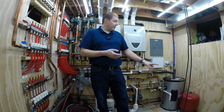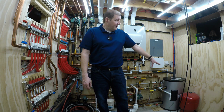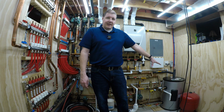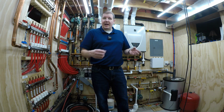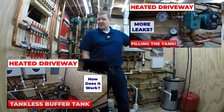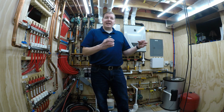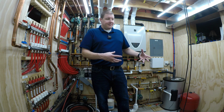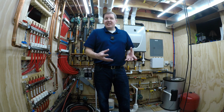So I'm also going to be doing some videos on converting my buffer tank here, which is an electric tank, an HTP 20-gallon electric tank that I took the electric heating element out of and put an aquastat in. And I'm just using it as a buffer tank. And I've got all sorts of videos that explain how I do that and why. But I'm actually going to be putting a 5,000 watt heating element back in that so that the electric part of it, again offset by the solar, can take care of more of the daily standby usage.